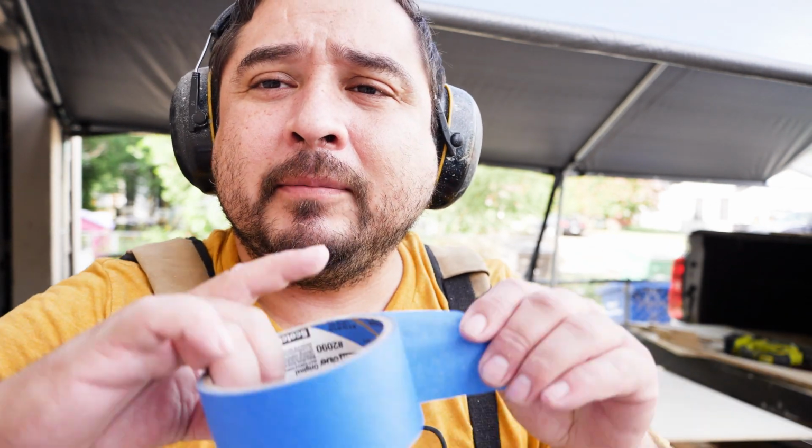So when you're cutting with the jigsaw, you can actually get blades that reduce the tear out, or that'll cut only on the bottom. Sometimes you get those chips. And for that front line that we're gonna cut in half, we don't want any chips because that's gonna make that line more noticeable. We can sand a little bit, but we really want to avoid chips. One way that can help, it won't eliminate the possibility, but it definitely helps, is blue tape. It helps reduce the chips a lot.